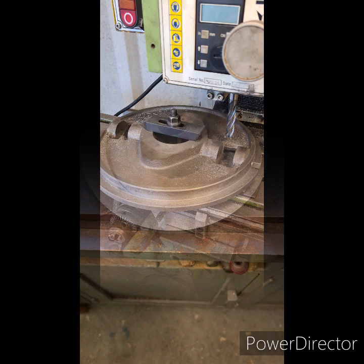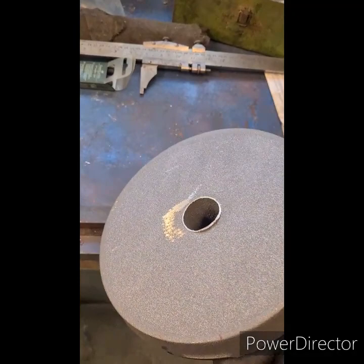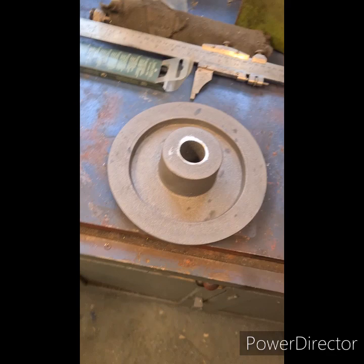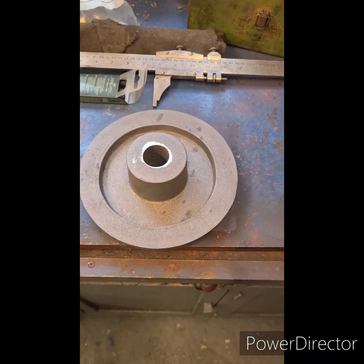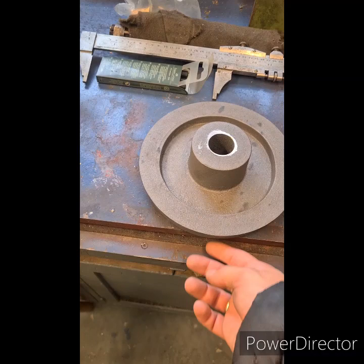Here we are then, starting on the crown wheels for the differential unit. Gonna hold in the chuck on this side and give this a face off, and then I'll hold it on the face plate by drilling a couple of holes, similar place to where the locking pins will be, and then complete all the work on this side, including the bore and the outside diameter of this, and then turn it around again, put the angle on these edges, and then get to cutting the gears.